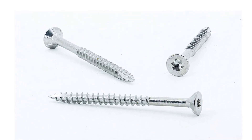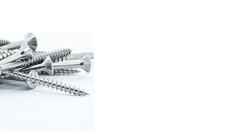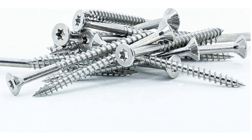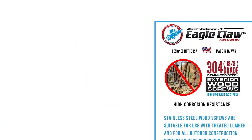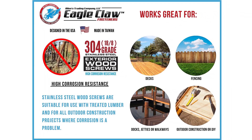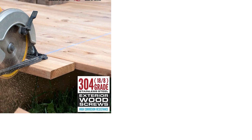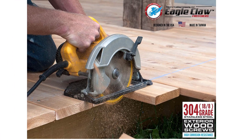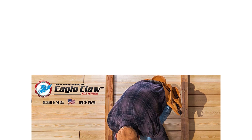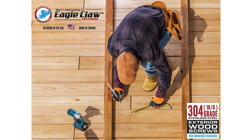They are compatible with softwoods, cedar, redwood, and pressure-treated pine, meaning you can use them on these woods without interfering with the structural integrity of the wood. Before investing in a fastener material, it pays to have a solid understanding of fencing nails, screw sizes, and the wood species you are working with. These stainless screws have the star drive Torx head that restricts cam-out, conserving the screw and extending the driver's life. The star drive is fantastic, and these screws go in smoothly and securely.